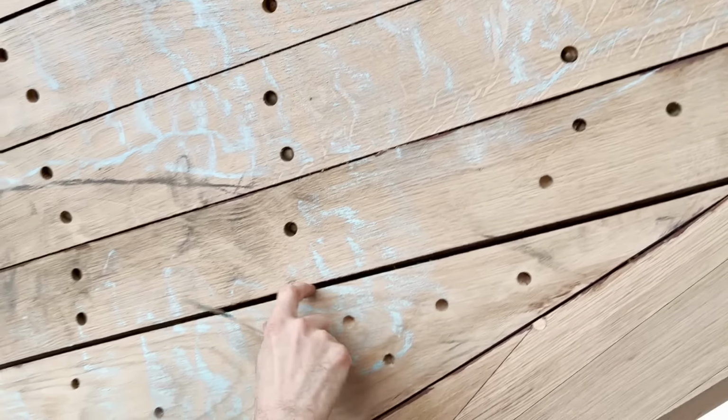So to get these lower planks swelled up enough that we can caulk, we only need to bring them up a few percentage. We don't have to go very far with it. And then when the boat goes in the water, all of this oak is going to behave like the oak in a barrel, and is going to swell and is going to create tremendous pressure between the planks, and it's going to crush that cotton, and it's going to crush that inner edge of the planking.